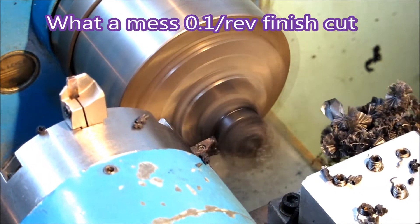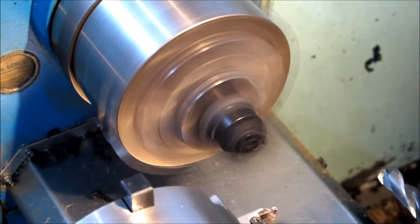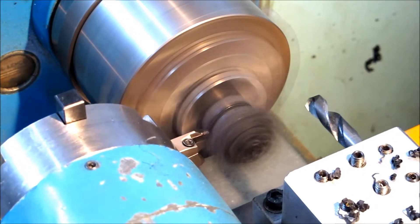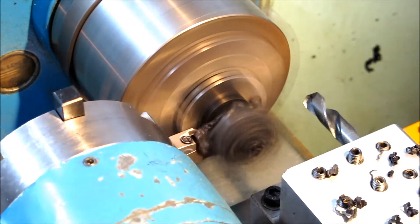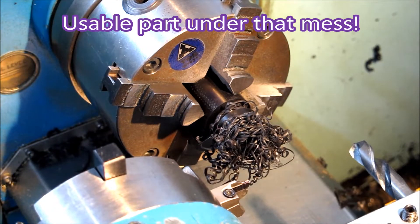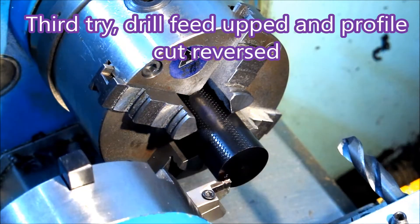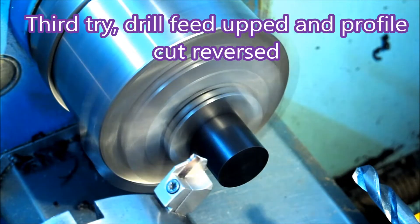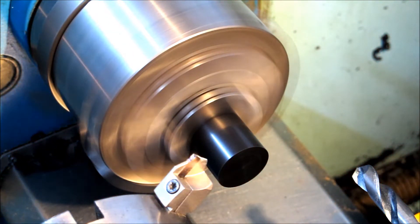At the end of that it's very messy — very messy swarf in the hole. I thought I'd pull that mess off but it wasn't coming off readily, so I just tapped it off as I usually do. So I thought I'd reverse the direction of cut for the profile and hopefully that would stop the swarf tangling in the chuck and around the part, and it works quite well.